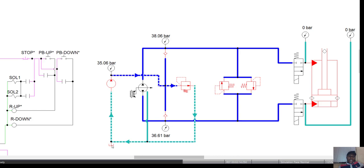Now let's have a look at the simulation. This tank is the source — the reservoir of the hydraulic fluid. The feed pump sucks pressure from the tank and goes into this tandem center, which is the point where hydraulic fluid is fed into the two lines. There is a check valve here which makes sure the hydraulic fluid in the closed loop doesn't return to the feed supply.